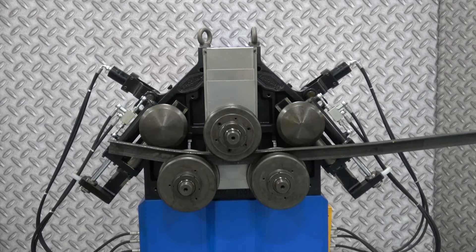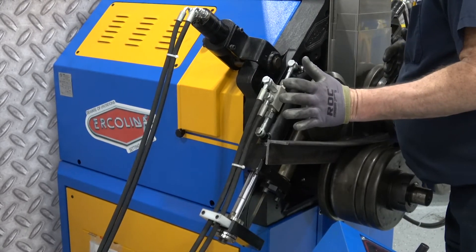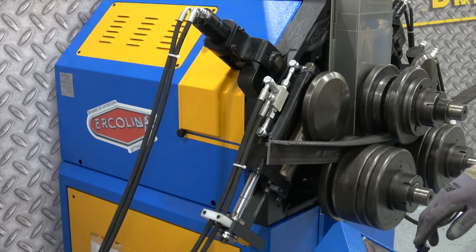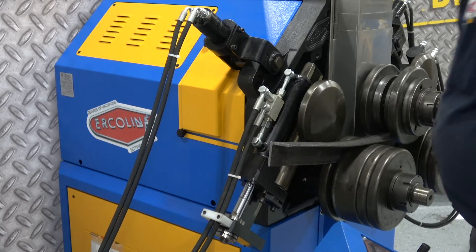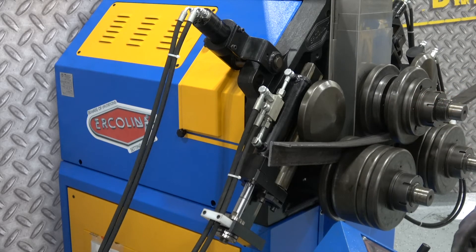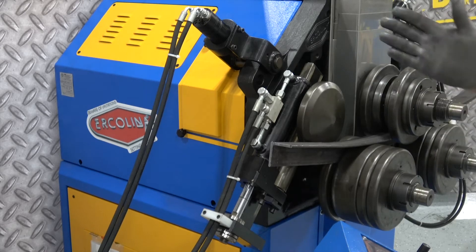Stop it. That's about a 7mm drop, and you can see the angle — it's going to roll or take it back in. That's where your conicals come in. I'm going to choose the left conical and bring it down, forcing the angle out on the tapered surface of the roller. Correct it so it's straight, and then continue to roll.